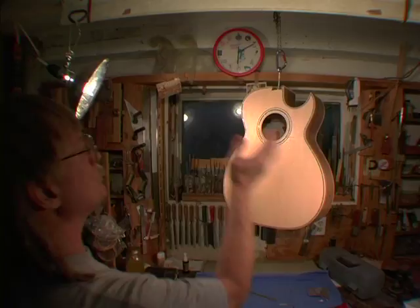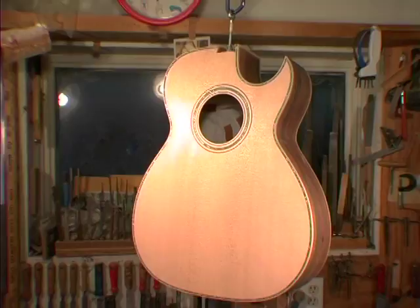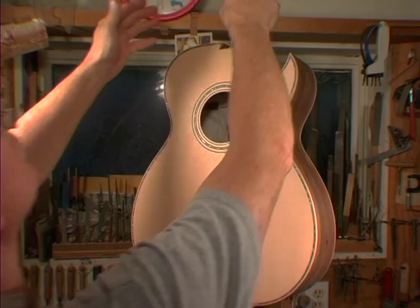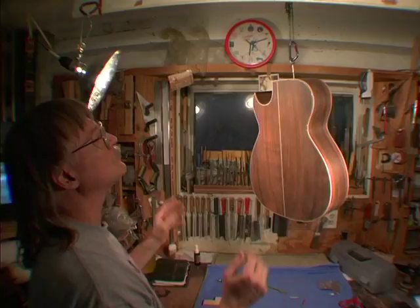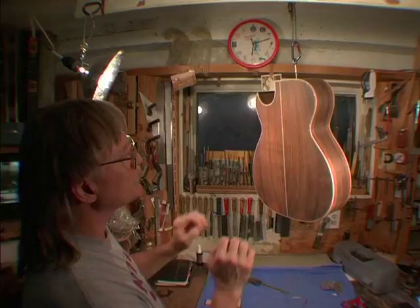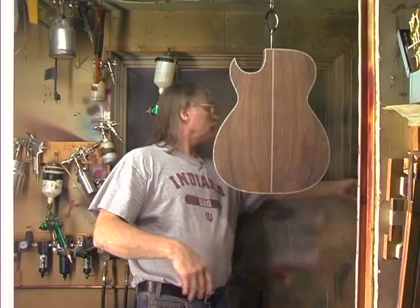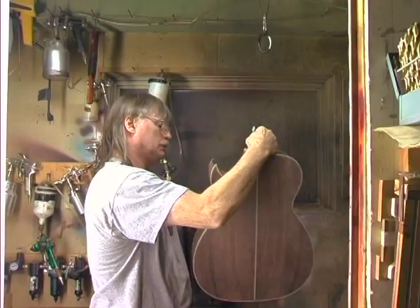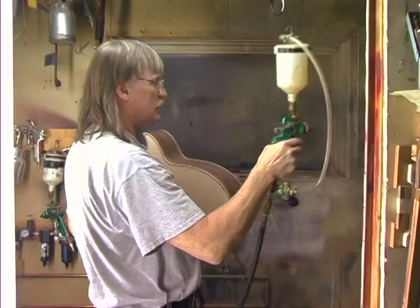This instrument is called what's called 'in the white' — it's totally finished, sanded, and it's ready to go in the paint room. The paper on the inside is obviously to keep the finish from getting under the back of the instrument when the spray gun goes across. You keep looking for any spot, and then the first coat of sealer I shoot on is really thin — that'll show up any small sanding lines or flaws, and then you can sand those out. Let's put this in the paint room and show you how to paint. You have to turn the fan on, grab a hold of it, and the gun's already set up — here we go.